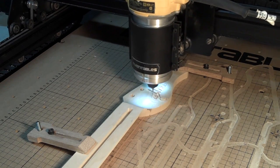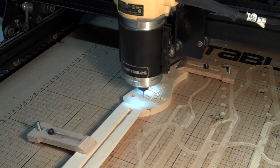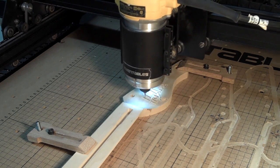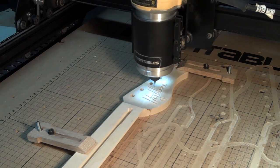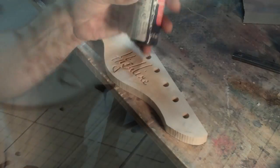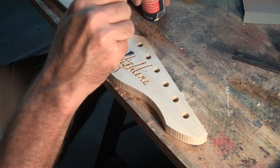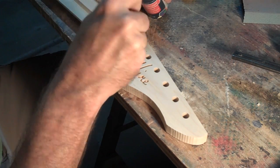In this case, what I'm going to be doing is painting the inside of the inlay, and then I'll fill it with a polyester resin. I'm using an inexpensive, big box hobby store water-based acrylic enamel paint, and I'm just going to brush it into the logo. I don't have to be too neat here — later on I'll go and sand away the excess.